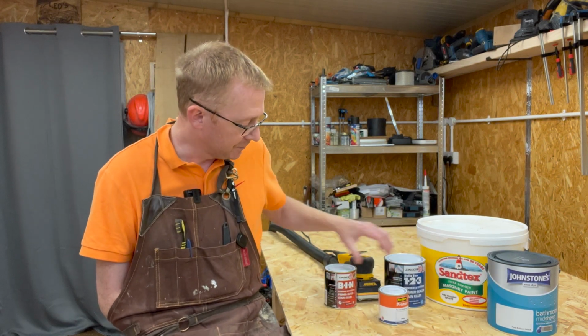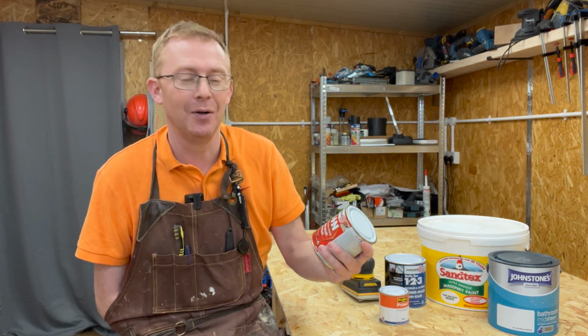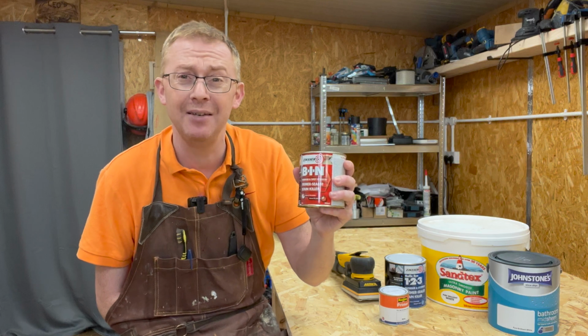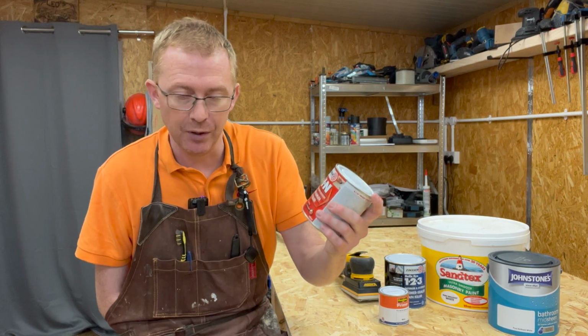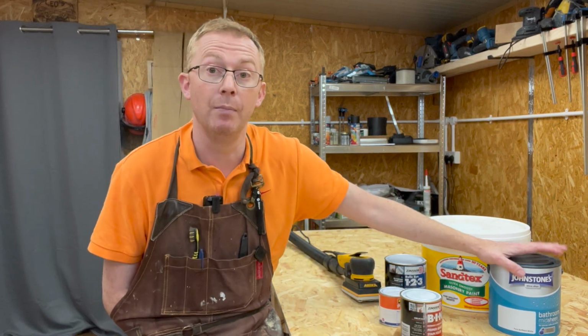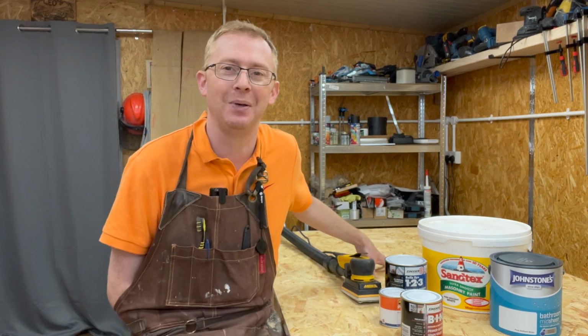And then finally, if you are on a better budget, shall we say, feeling a bit more flush, the Zinsser BIN, which I believe is a shellac-based primer and often considered probably the best on the market. So I've got this to run alongside all the other ones, and I'm going to put a coat of this on it, again sanded and unsanded, and I'm going to put a coat of emulsion over the top of it and also a coat of masonry paint, which takes me to 8 different techniques of either applying just a top coat or a primer and a top coat. And also, if I'm factoring in sanded and unsanded, that will be 16 different blocks on this piece of OSB.